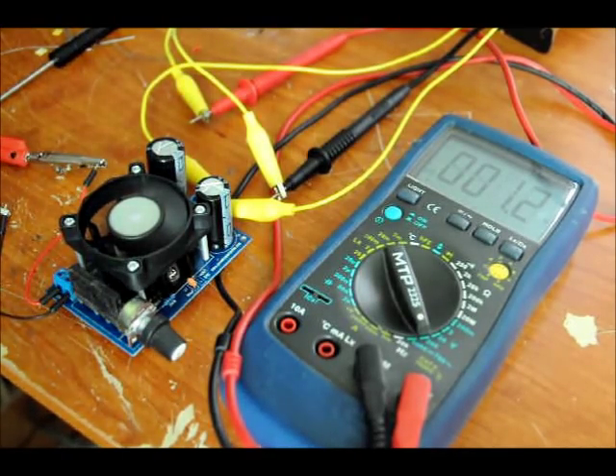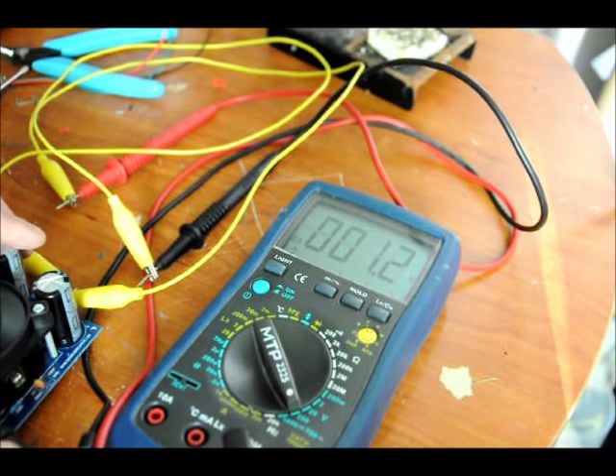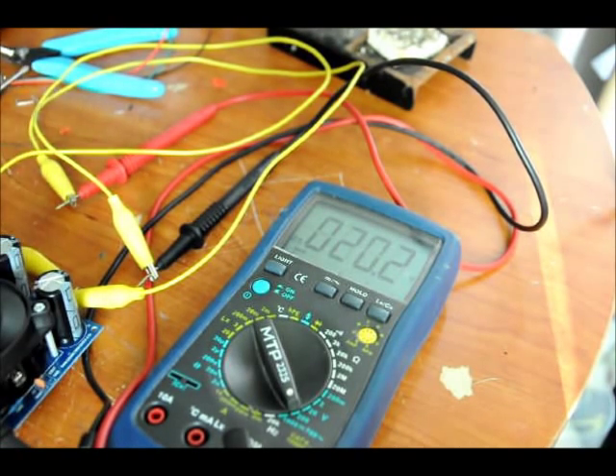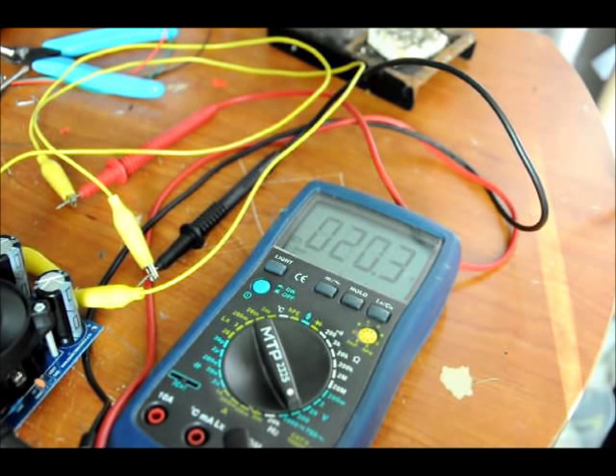Let's turn it on. Fan works. Our output is 1.2 volts, which is the lowest. We've got about 22 volts on the input. Because we have 22 volts input, we're only seeing a maximum of about 20 volts output — because there's a loss of a few volts on the bridge rectifier circuit. Now you've got a big power supply for your motor circuits. It's well heat-sinked with a nice fan. If you're ready to drive actuators or heavy loads, this is your kit. This can be used for tons of different applications. Thanks for watching, and I hope if you purchase this that you enjoy building it.